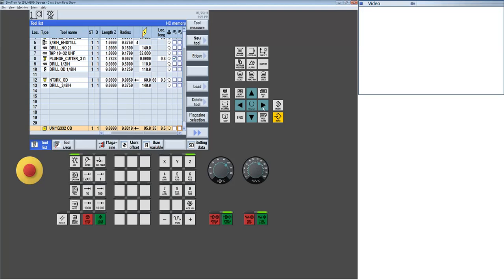There are a couple extra fields: your standard cut direction if you're inverting the tool, and your physical coolant selection. You may see multiple coolants depending on how the machine was built — a standard flood, and maybe a second option like high pressure or wash down. Once everything is filled out, the tool is created and defined. In this case the tool is unloaded, so we know it exists but it's not physically in the machine. To mount the tool, I highlight it anywhere on the field and use the Load button on my vertical soft keys.